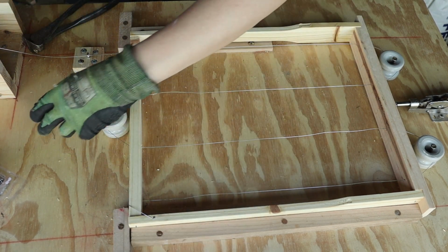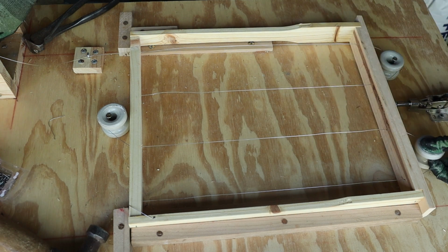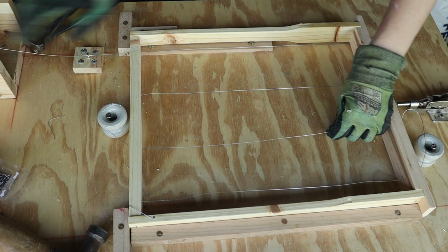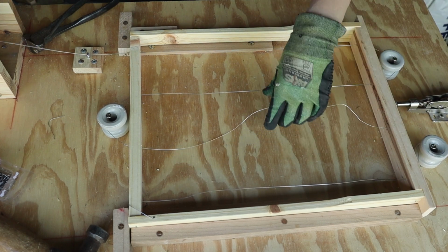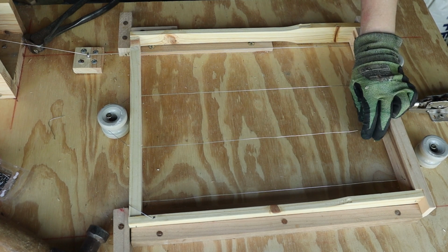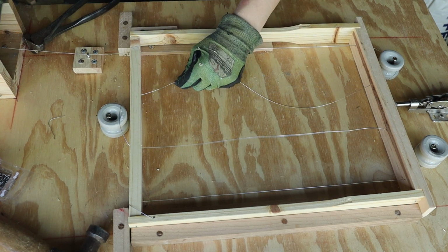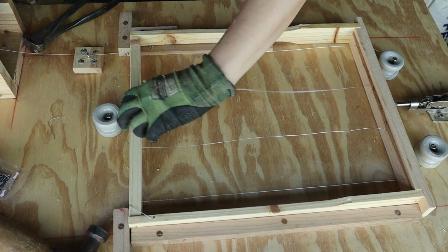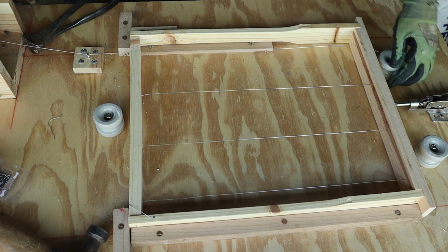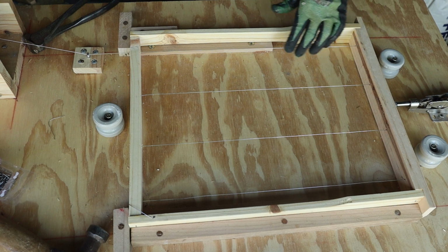And then it's time to take the wire off the insulator one string at a time. And this is the tip that Monty had for me, was just to really focus on tightening one string at a time and then leave it alone. So right now I'm working on tightening the farthest string, and then I just unwrapped the wire from the insulator, so now I'm working on tightening the second string. Pulling it off the third insulator and then tightening that last one.